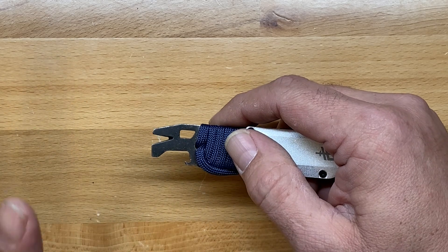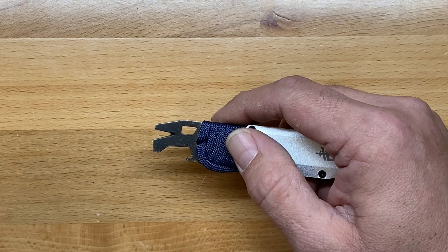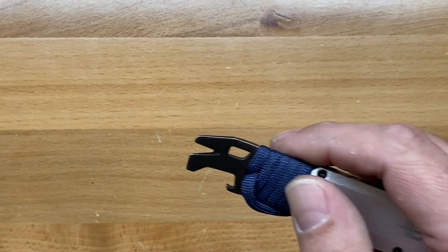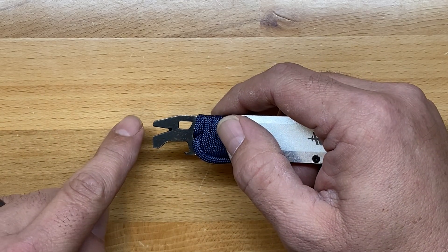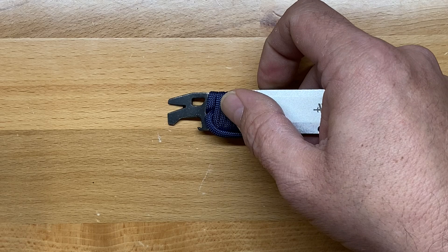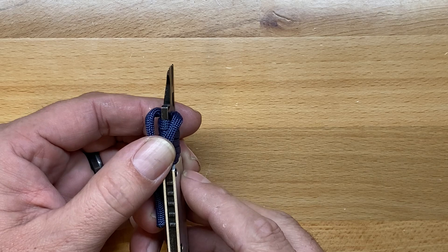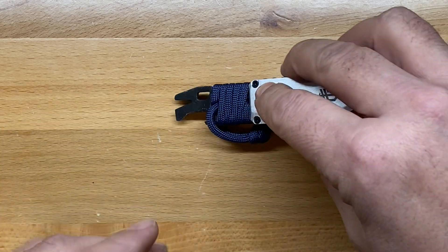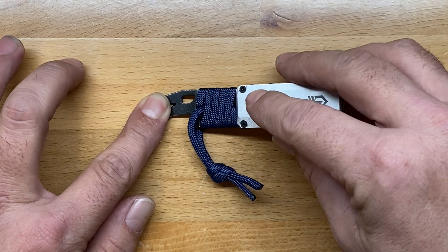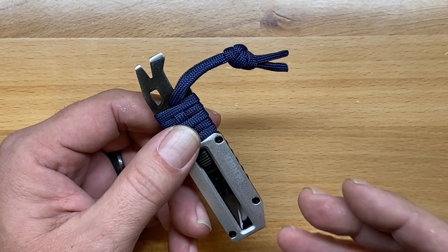There are actually several tools on the pry tool itself. On the wide side, they call that the pry tool, used for light duty pry tasks — opening up paint cans, little stuff like that. Then the V-notch is used for a couple of different things. The first is a little nail pull. This one doesn't have quite the kickover that the bigger version does, but it gives you a decent amount of incline — about 25 degrees — so you should be able to get enough pry force to get a little work done using it as a nail puller.